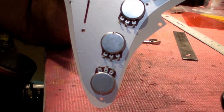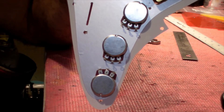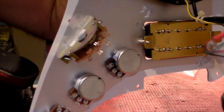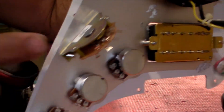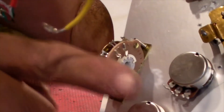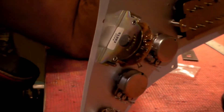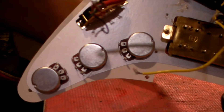This is the configuration you want — the two tone pots facing each other, and the volume facing down toward the tone pot. For the switch, you want it set into the pickguard with the steel plate facing out toward the outside edge of the guitar, and all the contacts facing in toward the potentiometers. If you put it in backwards, your selector switch positions will be reversed. That's how Fenders are wired.